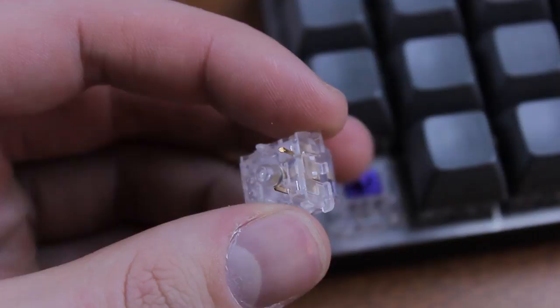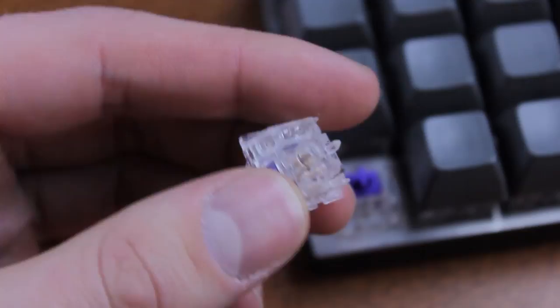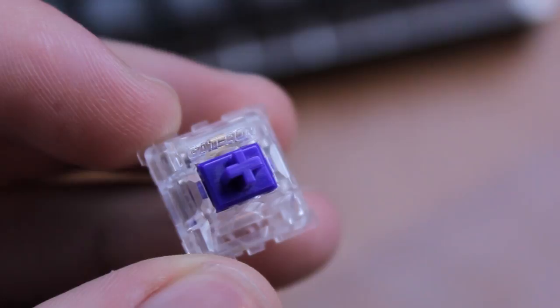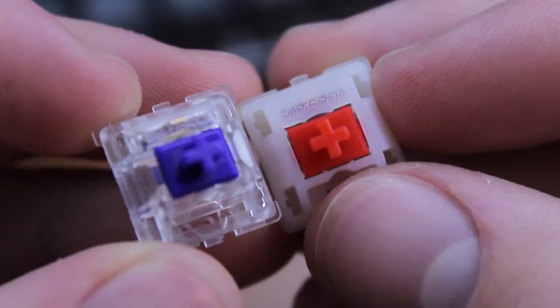As a result, these switches are not amenable to wave soldering techniques used in mass production assemblies, which I guess is ultimately one of the reasons why you won't find pre-made keyboards that come with these switches, so you can only buy them loose. This transparent housing is also more accommodating to backlighting, although you can get the standard milky bottom Gateron housing as well, which is more heat resistant.